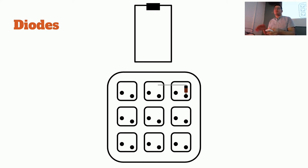Not necessarily, but what you're going to end up doing is using those diode legs to create a row, right? So here we're creating a row of wires with the excess leg. So the loop goes right here. You're going to solder that in, and then you take the other leg and you bend it over. So initially when you put it in, this leg is going to be sticking up. So then you just bend it over and then make it touch the next one.